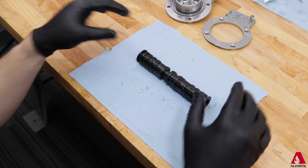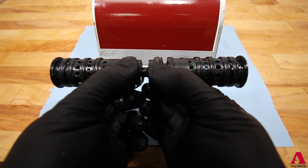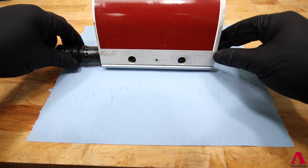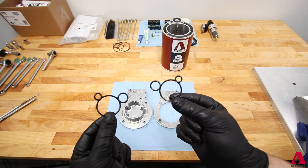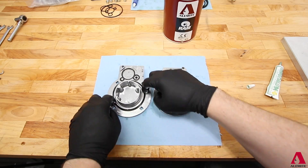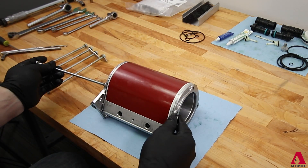However, if a seal on the valve is found to be worn, the air valve is replaced as one unit. After all components are cleaned, it is time to reassemble. Split the air valve spool into two components as shown — it will not matter the direction this is installed. Slide the first half into one side of the spool cylinder, then repeat the operation for the other side, firmly pressing the exhaust adapters flush with the cylinder head. The end caps have a tri-port gasket to install; be sure to liberally lubricate prior to installation, as this will aid in securing the gasket in place during assembly. The top cap has an additional o-ring to place in the groove. Use the label on the cylinder as an orientation guide to assemble the bottom and top caps to the cylinder, using the tie rods to temporarily hold the components together for installation onto the pump outlet body.